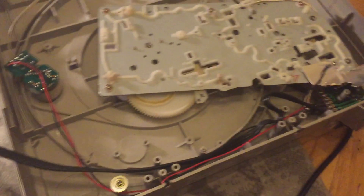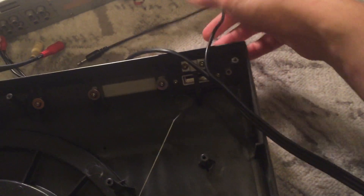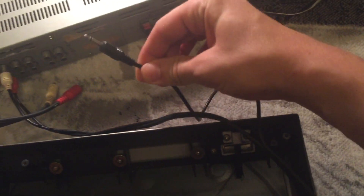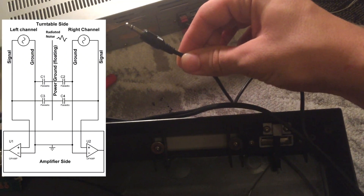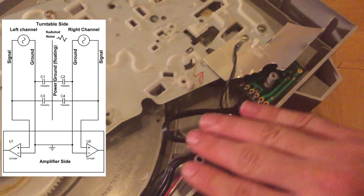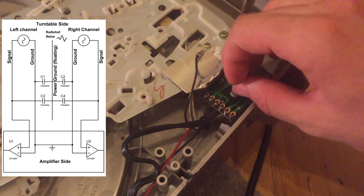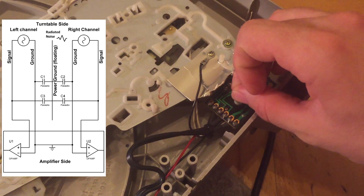But this other product is made to be supplied from a DC voltage from another part of the deck, through this wire. And it is revealed that if we follow this cable to its PCB, the ground wire is not connected to anything.